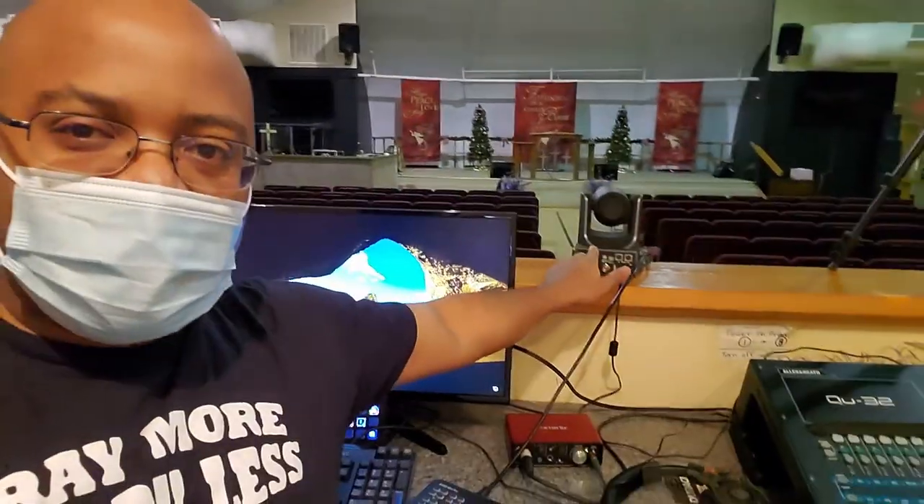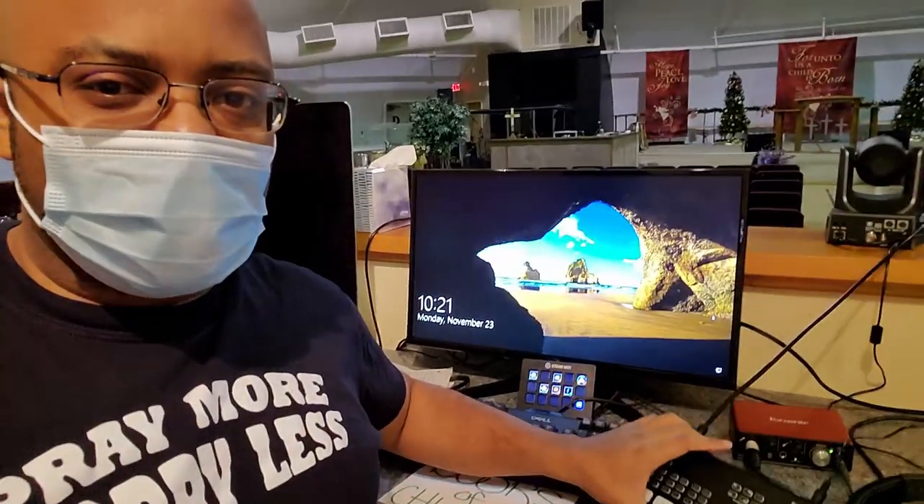There was a little misunderstanding, but we're still going to work with it. They actually got an ATEM Mini Pro, so we're going to hook up this PTZ Optics camera and mount it up here somewhere. I need to run some SDI cable back here and get some BNC connectors — I was supposed to have them delivered yesterday but they couldn't get into the mail room. I'm going to have to go to Lowe's. I also just ordered another SDI-to-HDMI converter because they didn't realize that's needed for this distance. I need to run Ethernet cable and SDI cable up there.